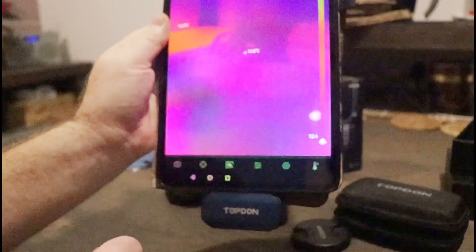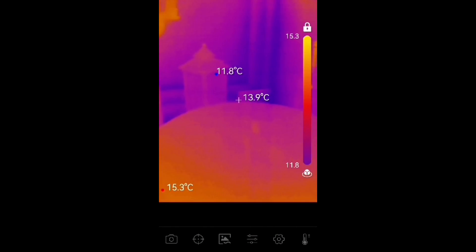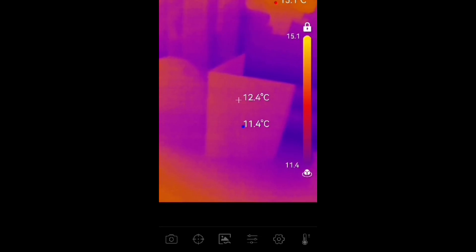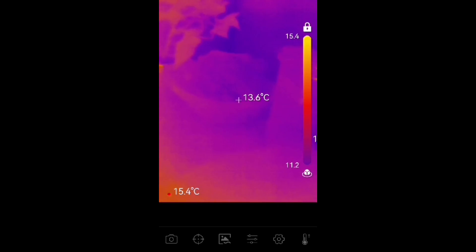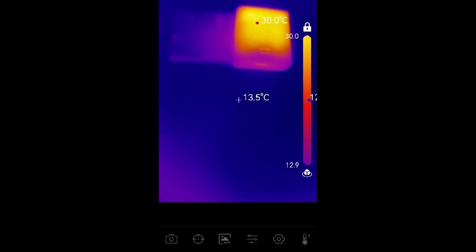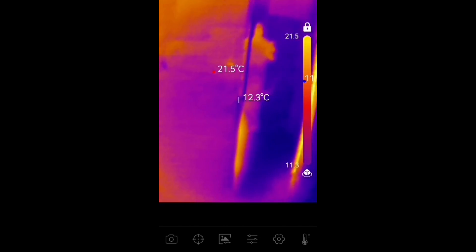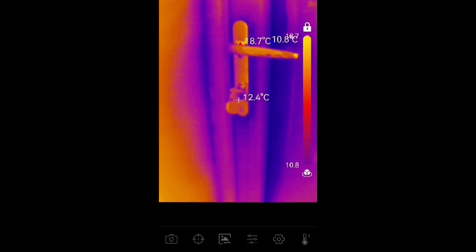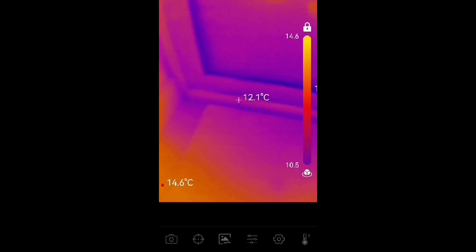I did a screen record so you can see what I'm looking at. I start by scanning around the window in our kitchen. It shows the definition of some items, though they are a little bit difficult to see sometimes. What I'm looking for are hot spots or cold spots. There's an Amazon plug in use — you can see it's warm, bright yellow. And around the windows and doors, you can see the darker, dark blue areas — that's where it's coldest. That's why you get condensation around the edges of windows.